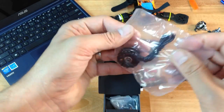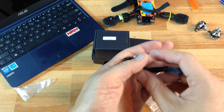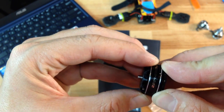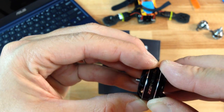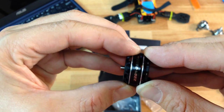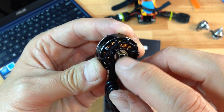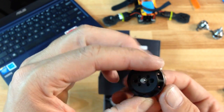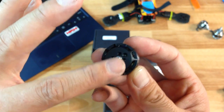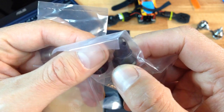Let me take a quick look at these - they look really nice. I've taken one out of the box already but I wanted to show you one coming straight out of the box. Alright, 2204 2300kv. With all motors I like to try and pull the bell off to see if there's any play, and there's absolutely no play in this motor. Look at the bottom - it's really well vented. The shaft is recessed and hollow inside, and there's a top cap that screws in right here.